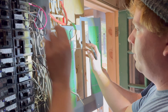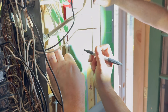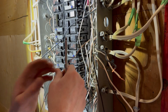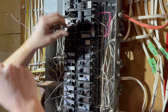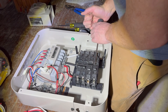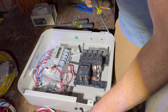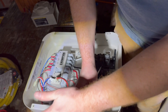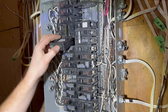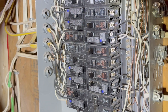There's usually a lot of wire and cable involved in an installation like this, so it's important that you label everything carefully so you get the correct circuits directed for generator powering. Here Mark is removing the arc fault-protected circuits from the existing panel and moving them to the manual transfer switch panel. Because the transferred circuits are arc fault protected per local code, Mark is required to replace the manual transfer switch breakers with AFCI breakers. Always be sure that any breaker you install is rated for the panel it's going into. With the regular breakers removed from the transfer switch panel, replace them into the main panel so that the holes in the cover are filled when it goes back on.